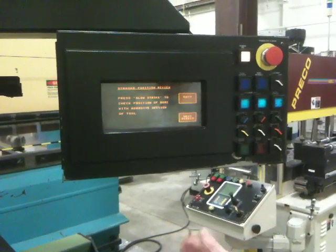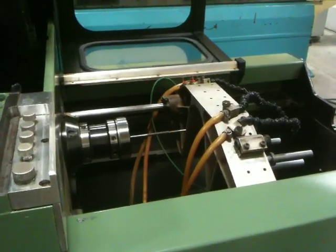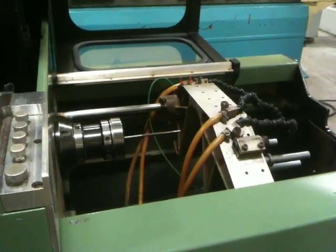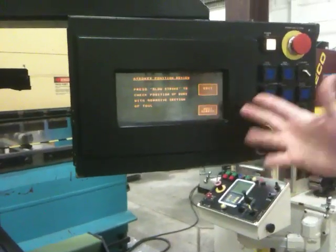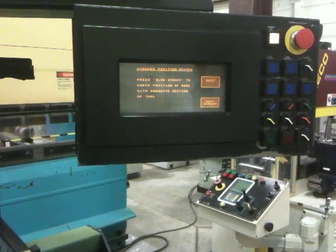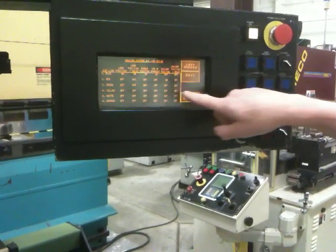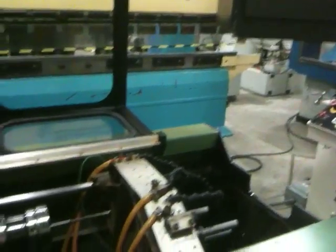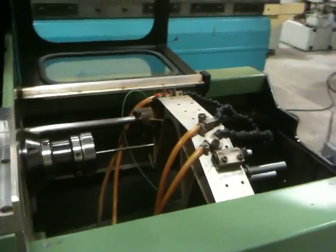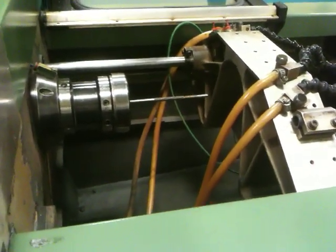And now we move slow stroke. Same reason, just to get it back and forth up on the part. Even though we're doing a dry run, I'll go through the motion. Slow stroke down here. That's a slow stroke. So now we're ready, the part's ready, we're loaded up, we're all set. Go to the next screen, we're getting close here. We just about got our setup in. Sets itself. These are all the air switches and positions where you want your air fixturing. Right now we're only running one clamp, which is the red on, and then clamp off, which is green at the end of the cycle. That's it.